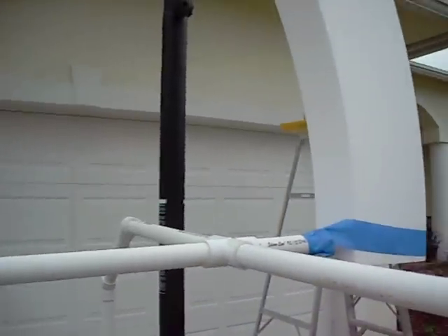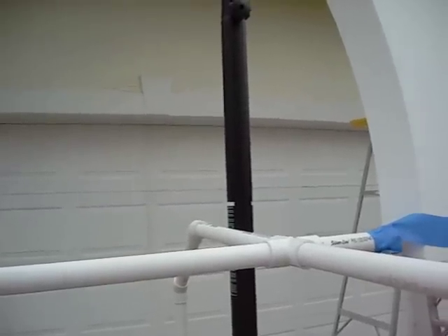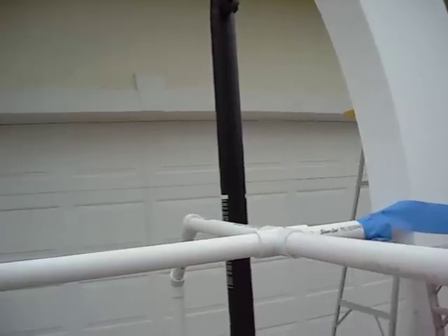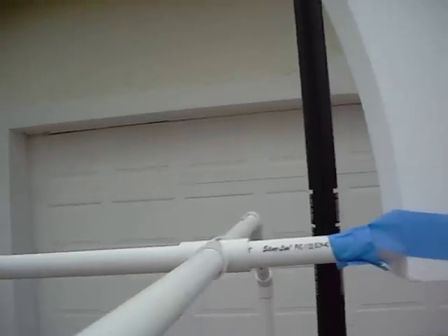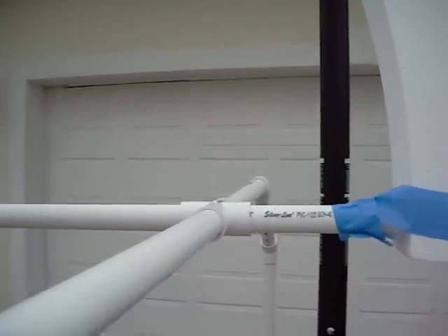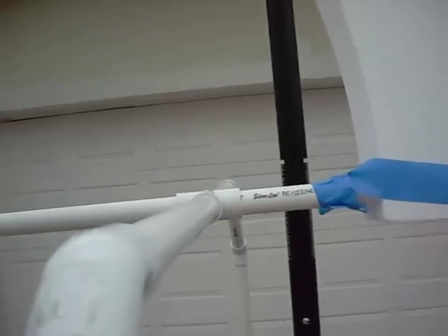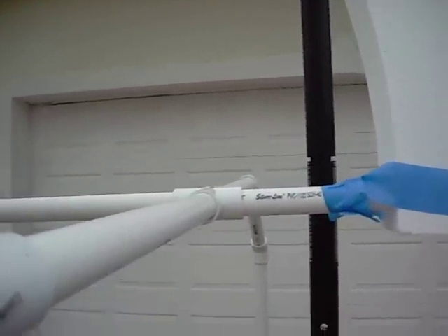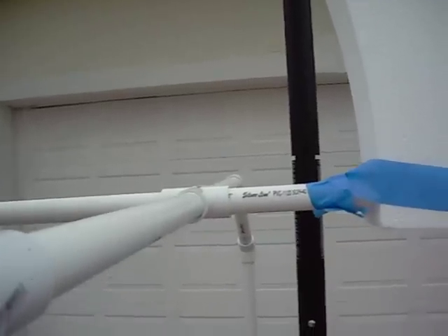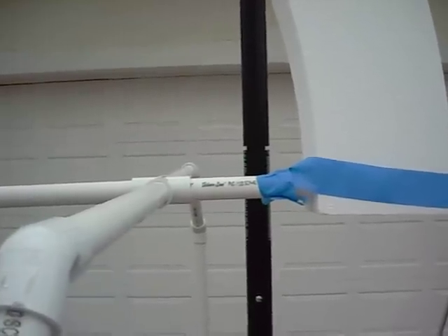That placement gives some spacing between the metal frame of the capacitor and the wire itself. I'm going to use a four-gang capacitor where each gang is 500 picofarads. By running two gangs together on both ends and connecting the coil termination points to each stator, I'll be running wiperless. I've experienced on loops that using a two-gang 1000 pF capacitor or a four-gang split that way allows the frame of the variable capacitor to be at near-zero potential, eliminating hand-capacitance detuning.